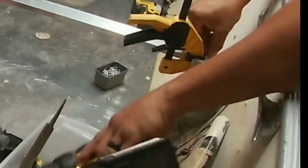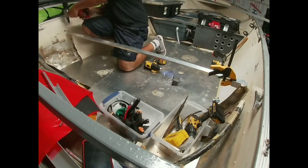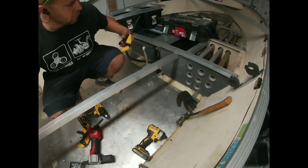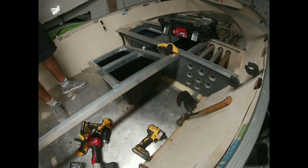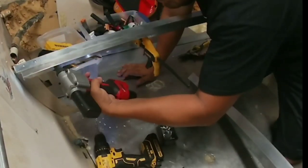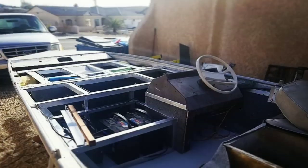Here I'm trying to use parts of the boat that are pretty key — ripping them out would cause pretty deep damage to the hull, so I kept them in and tried to use them. Whoever lined up these side pods did not line them up straight when they built it, so that's why we have that little offset angle there. We need this part in before we can do the rest. The cool thing about Gen 5 is we got rid of most of the flat bar underlay — the 1/8th inch flat bar underlay we had in Gen 3 and Gen 4. Gen 3.2 retro, the same framing we used for the tracker, also more or less got rid of it.